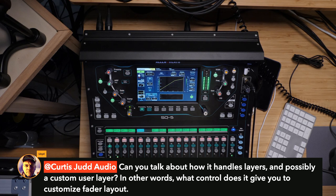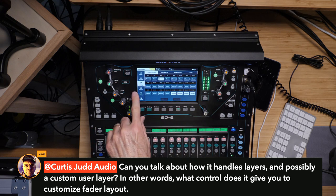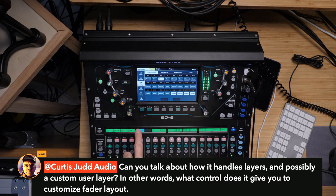Because with transitions, if you're using, for example, a phone to play music at the intro, you want to do a pretty smooth transition. You want to be able to fade out, mute it, unmute the dialogue voice, and then continue on with the program. So the way I did that, in a digital mixer, you can come over here in the config and gang inputs 5 and 6 into a single stereo channel. That's one way to do it.